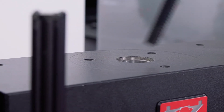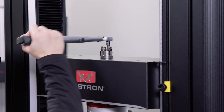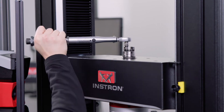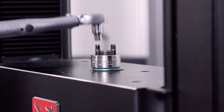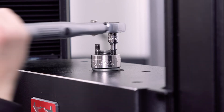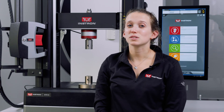How it works is the super bolt threads into your load cell like normal. However, it has four smaller bolts that you tighten individually at lower torque values with a standard torque wrench. They collectively push down on a hardened washer to provide the necessary tension to secure the load cell. With all four smaller bolts tightened, the load cell is now securely mounted and ready to use.